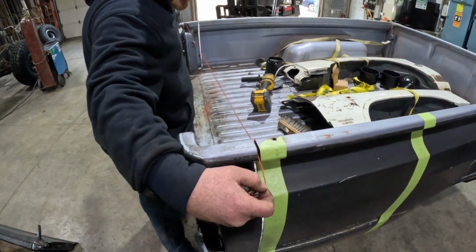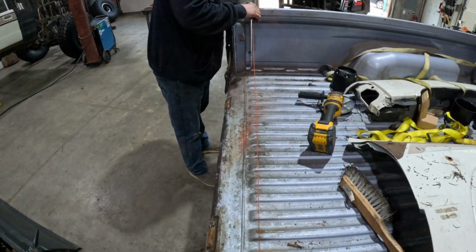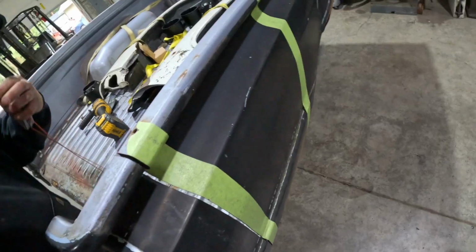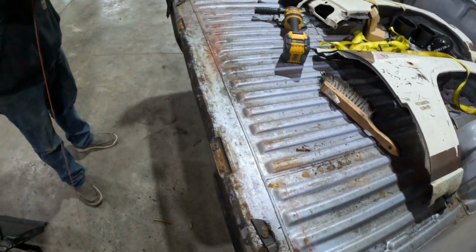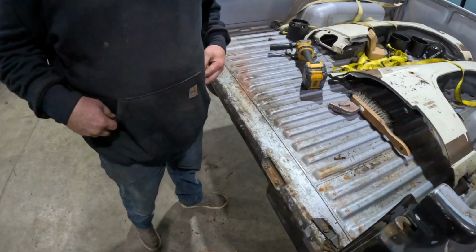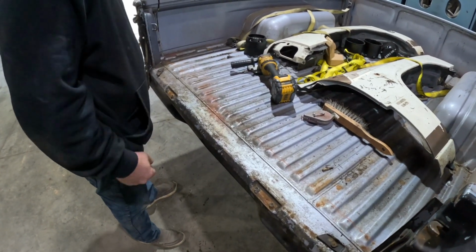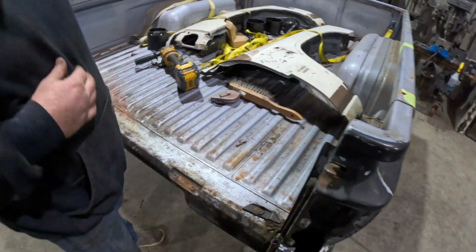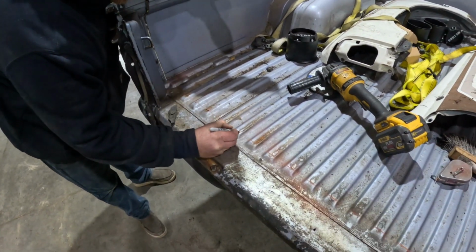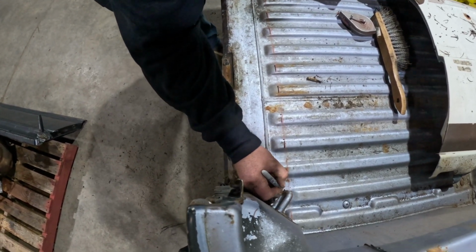Let's drop this right there. Drop that. Right there. No. Cut it. No, because the velocity of the sparks coming out of here will blow your line off. So you got to mark it with a Sharpie. Otherwise the dust will blow away. Just kind of like maybe every other one. Just be wiping the chalk into the Sharpie. Somewhere in there.